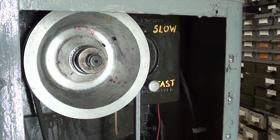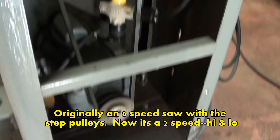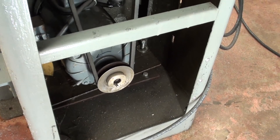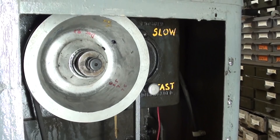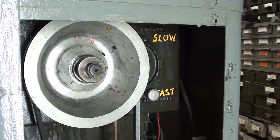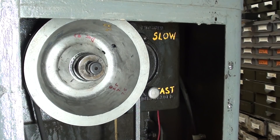This is a four-step pulley, but if you look at the lower motor, that step pulley was missing, so I just put a variable-pitch adjustable one on there. Now it's not that easy to change the speed — it's presently on fast, or direct drive — and I'm going to shift it into low just to show you how, but you do have to take a few moments, open the door, and fuss around with it. It can't be done from the front of the machine.